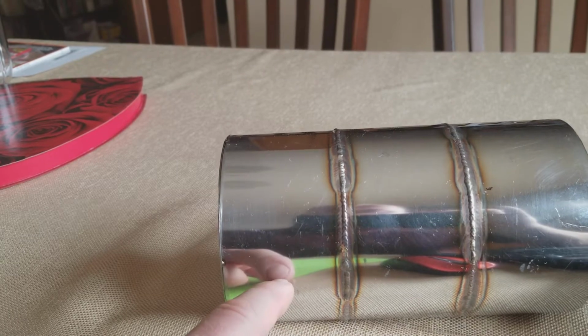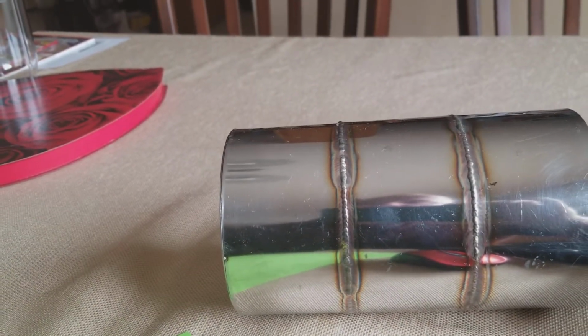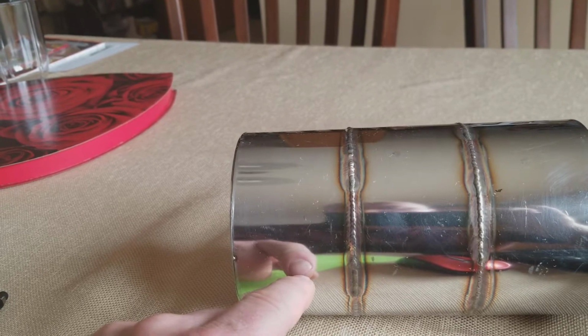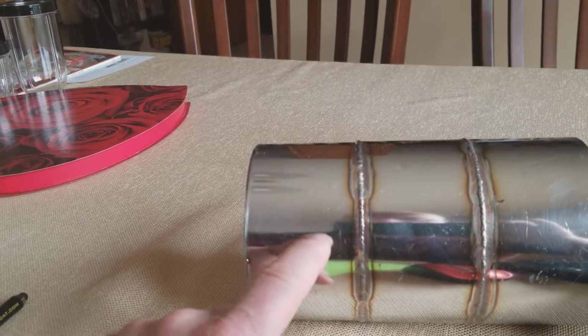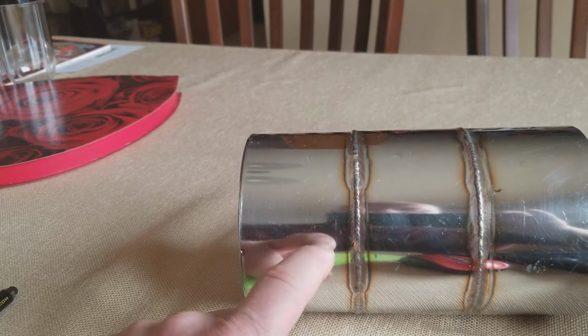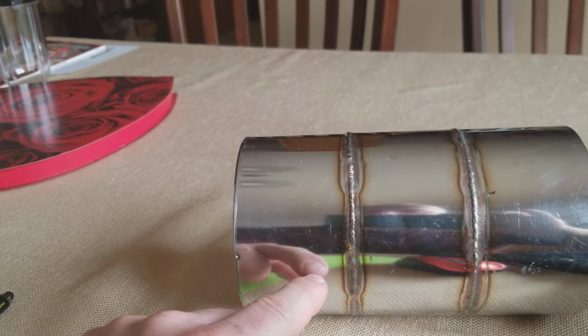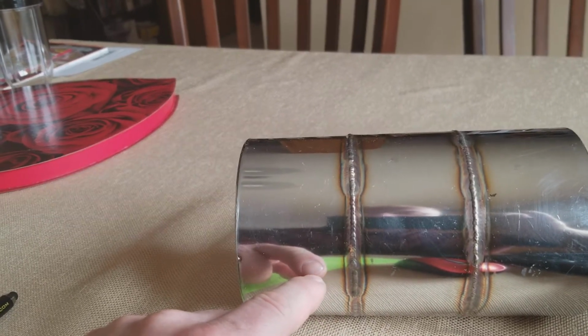So the easiest way that I've found to do that is through relative on your screen. Pretty much every machine I've worked on, they have a deal called relative in your manual offsets. So I went to relative and cleared out the Y and the Z to 0. So on the other side like this, the profile here is nice and round, and you can pick up the profile of what the radius should be on the seam side where you're trying to machine that down. So I picked up Y0, Z0,